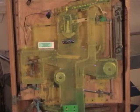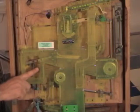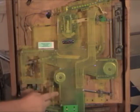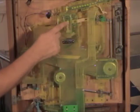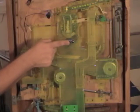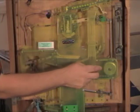Now let's look at what happens when you get a jackpot from the back. I'm going to drop a ball right through this hole — one of the pockets in the front — and it'll roll down and enter into your seesaw right here. That seesaw will pivot; the ball rolls over here and down, hits a little metal arm that goes all the way across and pivots that arm down. As it pivots down, it pushes up on this rod, which pivots all this linkage, causing your jackpot rocker arm — this white arm here — to lift up. All the balls in the assembly drop down, hit a metal plate making a nice sound, roll over to the white arm, pivot it down, roll across, hit this bell causing the ringing sound, and then go out to your front play tray.